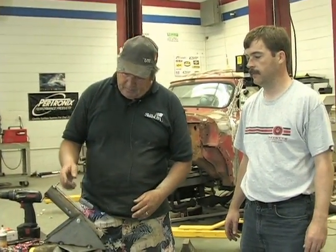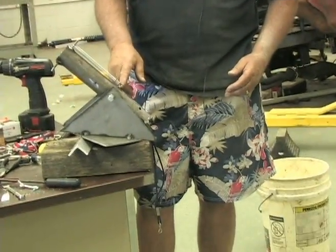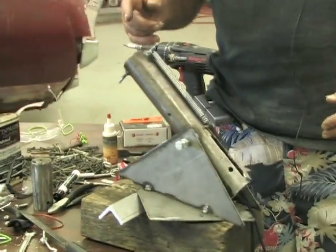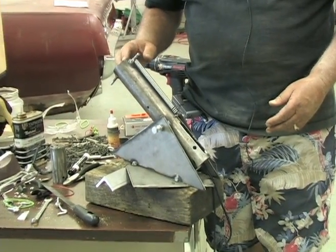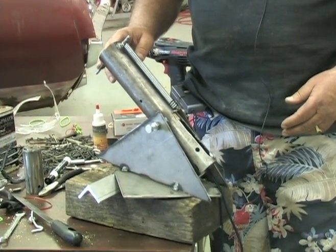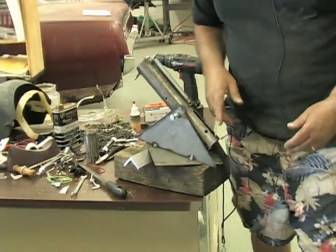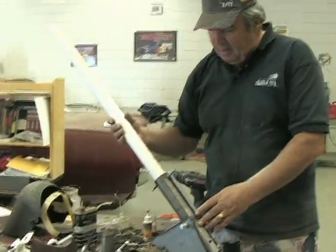After that, Mr. Fisher came up with the idea of going to wood, so we went to Lowe's and purchased a wooden dowel. The dowel was fine except that we kept getting a lot of variables. It didn't fit the bore close enough, and it was the largest diameter that we could get. So we did some brainstorming and came up with the idea of taking a piece of PVC pipe and wedging that in the bore on the thimble, and this fit in the bore really nice. I'll just show you how that fits down in there nicely.